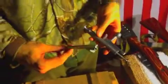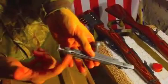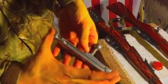Take the guide rail and hold it like this. The firing pin should have a horizontal parallel flat as well as a round side, matching the hole on the guide rail. Slide that in and slide it all the way down. You'll see the notch on the rear of the cocking knob slides right in perfectly on the rails.